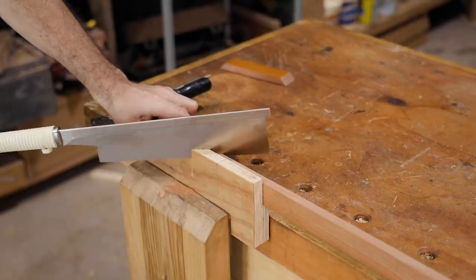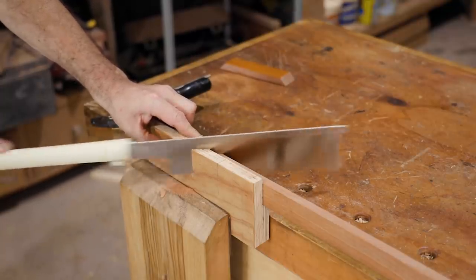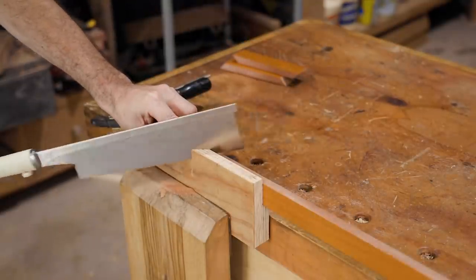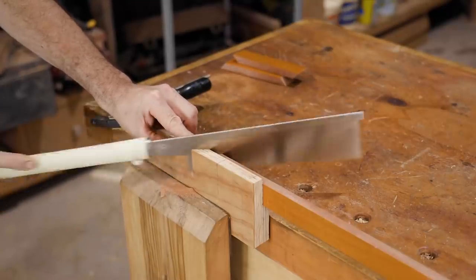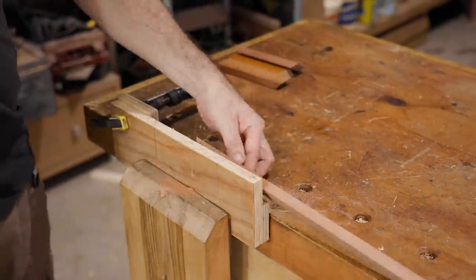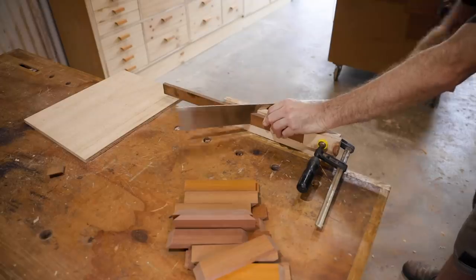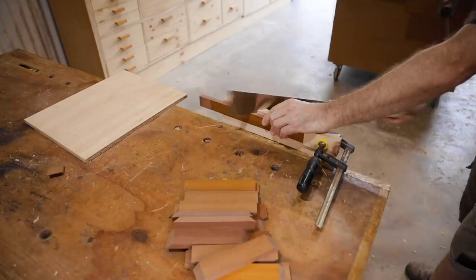Now I'll start cutting the pieces for the drawers. The two back pieces are identical and need miters on either end. All the parts will become more clear as the video progresses. The project has 4 drawers in a layer, and as I'm making 4 layers, I need 16 drawers. If you have a crack at making this yourself, you can make as many or as few layers as you want.